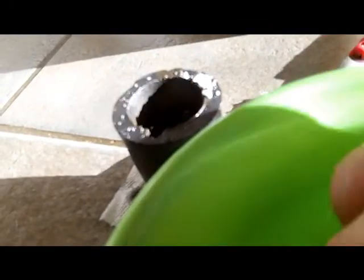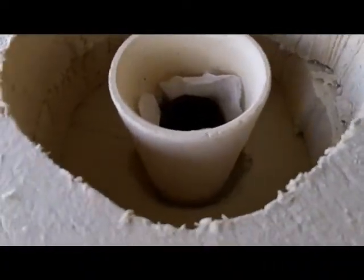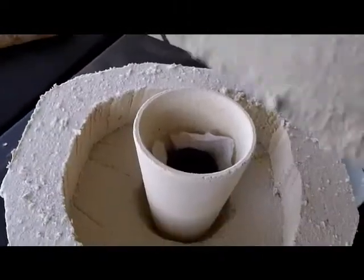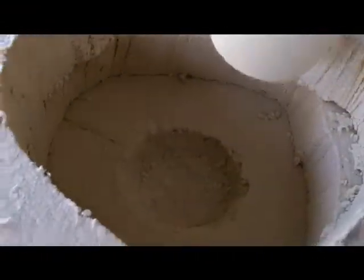Water will actually help absorb microwaves at the beginning. What I understand is it's a long haul from the time the water is gone to the time the glass is red hot — it doesn't absorb any microwaves during that phase. So this is all loaded up. These are just some insulating panels — a very light material that won't absorb too many microwaves. I've also cut as much of that away as I possibly can, with a nice little seat down in there for my crucible.